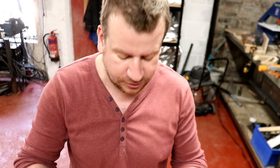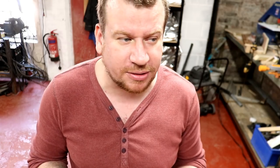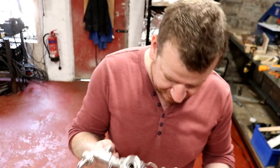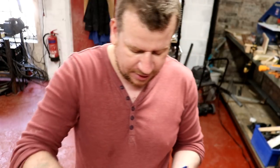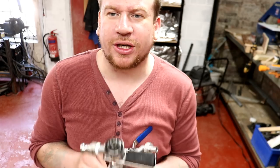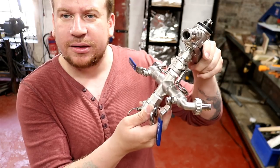It's heavy duty, 20 bar rated, rubber, FDA and EC approved, food grade use, approved up to 70 degrees C. So it's not the kind of hose you want to be using for recirculating beer or anything like that, but for cleaning caustic, and because it's got high 20 bar burst pressure. I'll show you when it arrives, but I think it'll do the job for hooking this contraption up to our cask washer and converting it into a keg washer. What do you reckon to that? It's almost like the space station, isn't it?